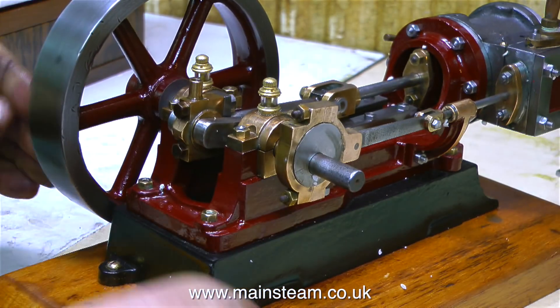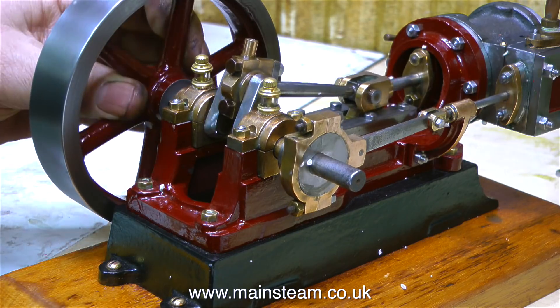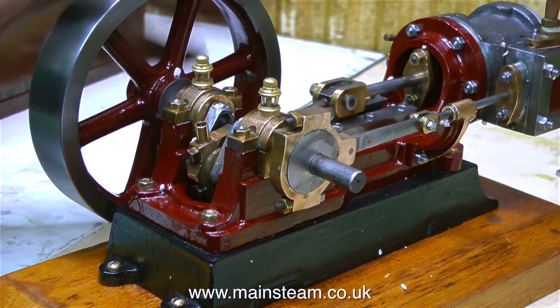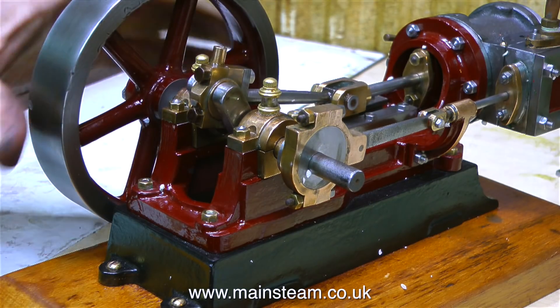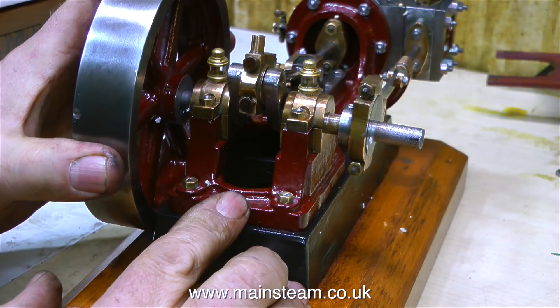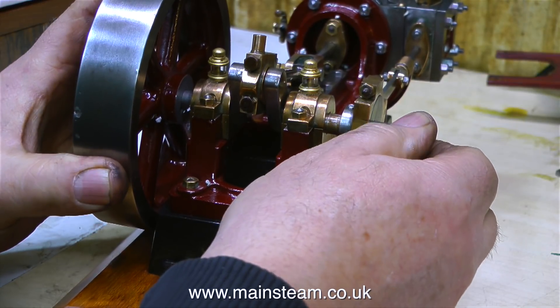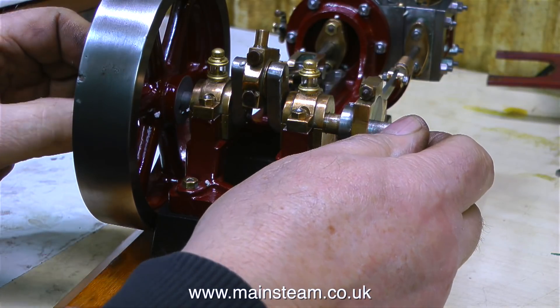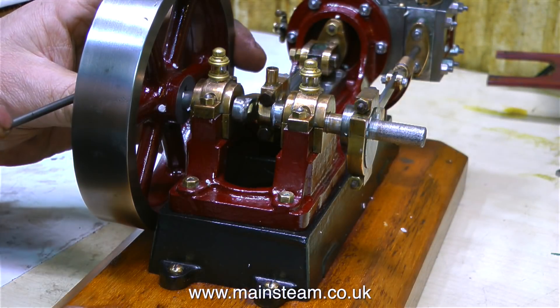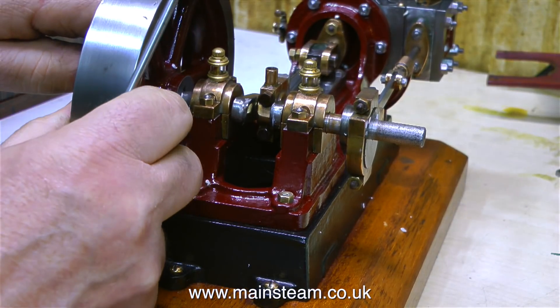So what's this example like? Well, I don't know really. It's difficult to tell at this stage — it's looking a little bit suspicious to me. It would appear that there is quite a lot of play in certain areas where there shouldn't be any play at all. Look at the play in the crankshaft — this is quite excessive. With this amount of play in the crankshaft bearings, it's one of two things: the main bearings have either been machined oversize, or the top caps are just very, very slack — or a combination of both.